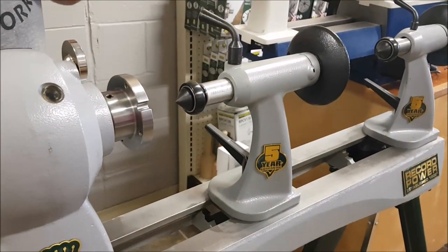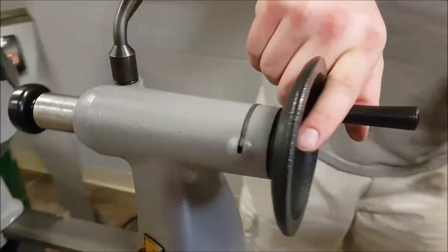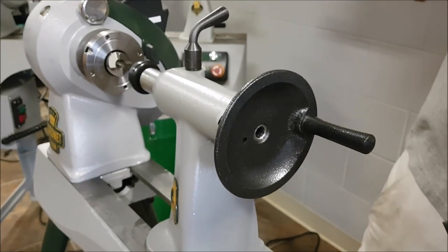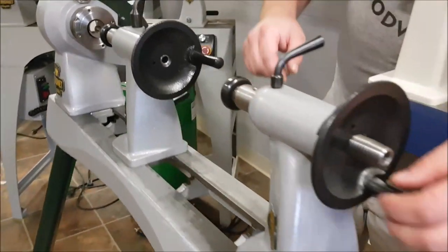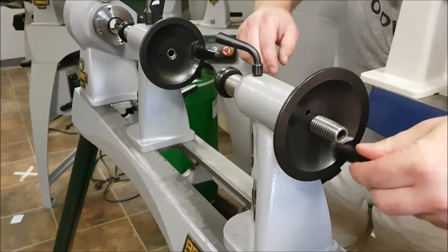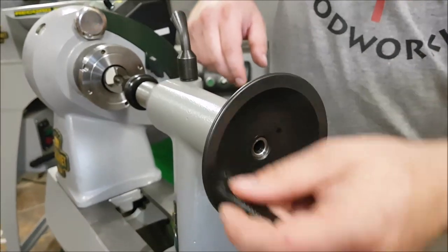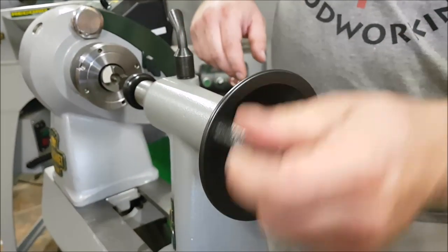The other really big thing — if you look at the back of the hand wheel here, you'll notice that thread in comparison to the old design is all integrated. So if you guys already have the original, that thread moves back and forth and gets shorter and longer. This one here is integrated, and you're not going to wrap your knuckles on it, which is really, really nice.